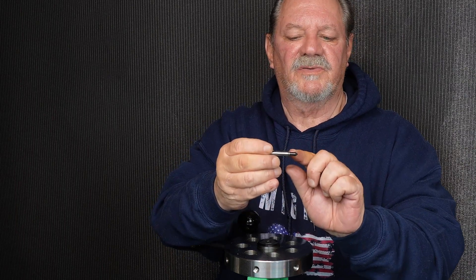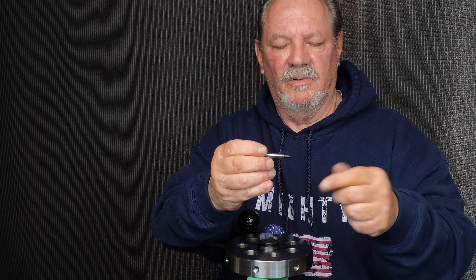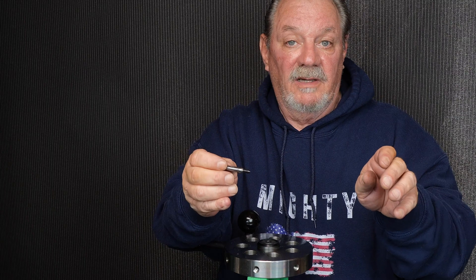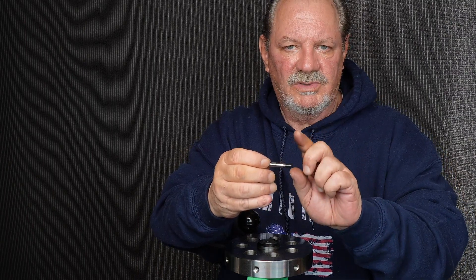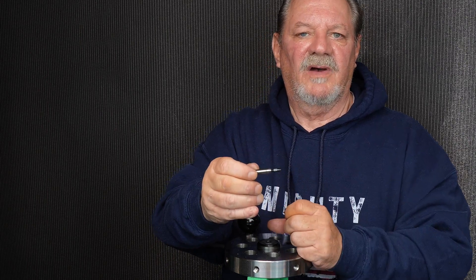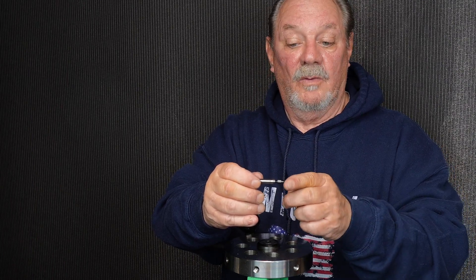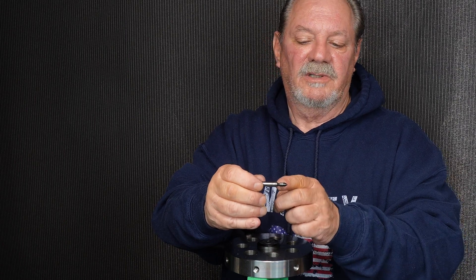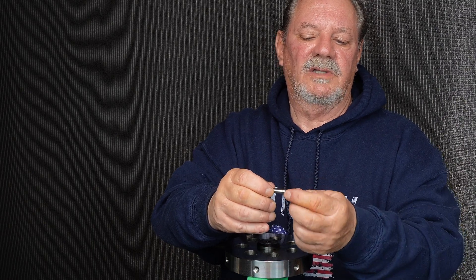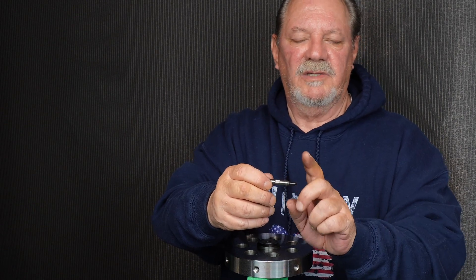The last thing you want is for the pin to loosen and work its way out and make contact with the flash hole on the web of the case and spread it — you don't want that to happen, so use the Vibratite. Also, if the pin walks out far enough that there's no contact at the angle of the pin or pointer, there's a lot of pressure on the pin right at the thread area and it can cause a crack and eventually a break on the thread barrel, which works its way into the shaft. Make sure this is secure.